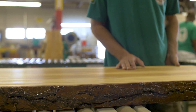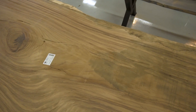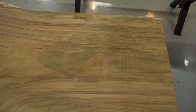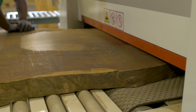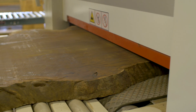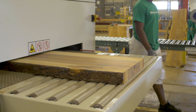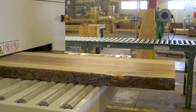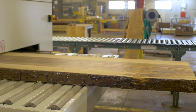When you see dark spots in the photos, that just means that area hasn't been milled down enough yet. If you want it milled perfectly smooth, just give us the finished dimension you want and we can smooth it out more. We leave them partially surfaced until you're ready to work with them, because wood is like a sponge — it gains and loses moisture and moves around a little. Until you're ready to put the finish on, you don't want to go down to the finished dimension, because the finish will slow down moisture exchange and make the wood more stable.